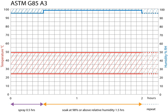Most salt spray chambers today are being used not to predict the corrosion resistance of a coating, but to maintain coating processes such as pre-treatment and painting, electroplating, galvanizing, and the like, on a comparative basis. For example, pre-treated plus painted components must pass 96 hours neutral salt spray to be accepted for production.